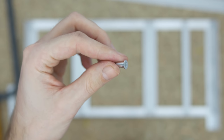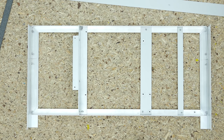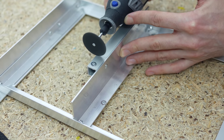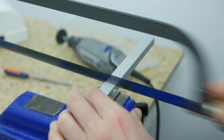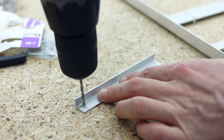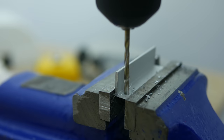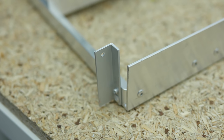I fixed a threaded insert in each opening. Next I had to make two small cuts for the insets on each side of the riser — Mr. Dremel helped me sort this out. After that I cut another piece of aluminum to sandwich the PCI Express connector. I put a threaded insert on each end, drilled holes in the top piece for the screws and assembled the riser construction. I fabricated mounting supports for the GPU I/O bracket, fixed it to the frame using two rivets and drilled a hole for the screw.